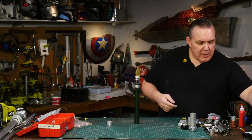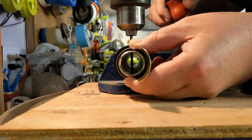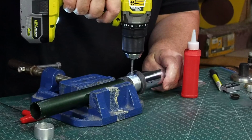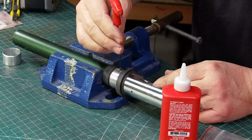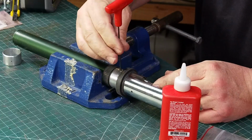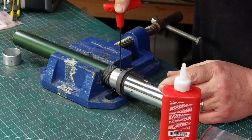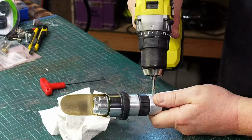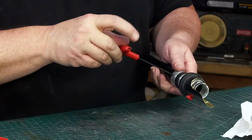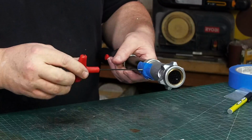All right. I drill my pilot hole through both aluminum pipes and through both sides. And then I can tap each hole with my 8/32 tap and insert the set screws that'll hold the pipes together and possibly hold some of the electronics inside of the saber. And then I do that in multiple places with many screws all over the project.